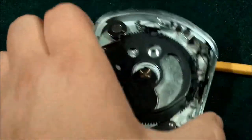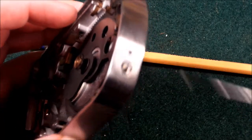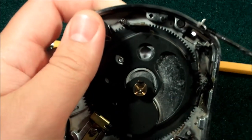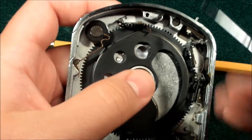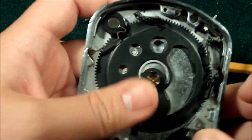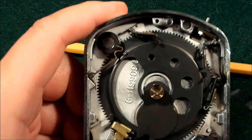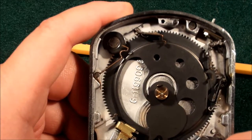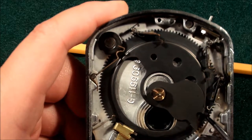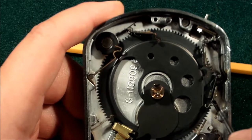There is also an electronic synchronization built into these Polaroid shutters, via a bi-pin connection on the top. One pin goes into the body, and the other exposed pin is wired by an insulated connector down into the very first of the shutter stops. That means when the shutter is in the fastest position, that stop will come into play, and when the shutter blade hits it, it will be grounded and create the connection for the electronic flash. The electronic flash synchronization will only operate at the fastest shutter speed, 1/100th of a second.